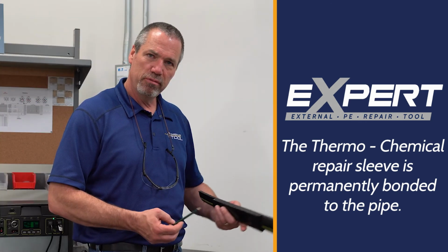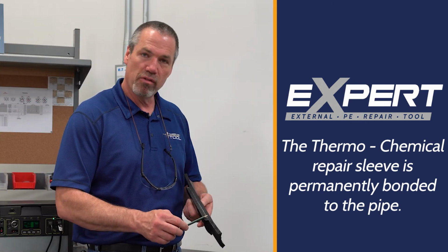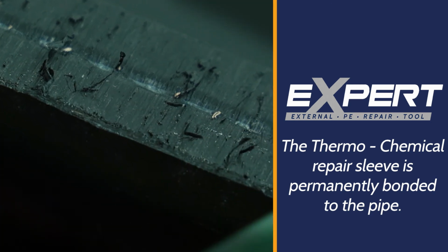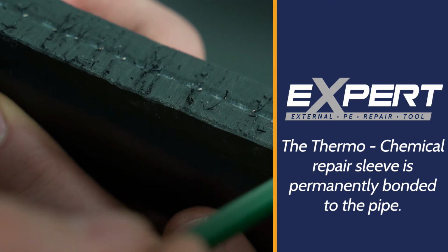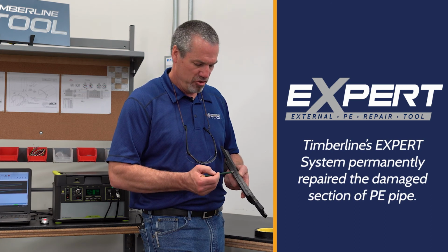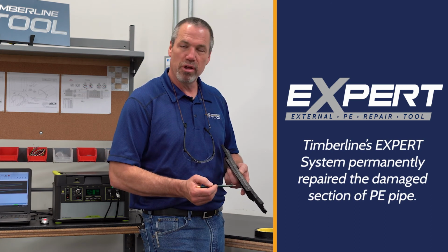On this cross section, it's a cross section of the entire length of our repair sleeve. Again, we're looking, there's no gaps. You can see the wires from our heating source that was embedded inside our sleeve. Again, nice uniform joint throughout the entire bond.